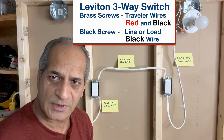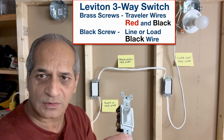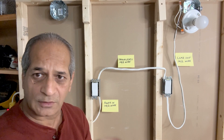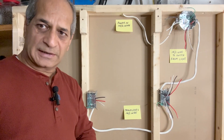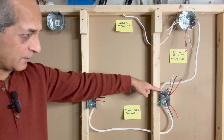In this demonstration I have used Leviton Decora type switches. To maintain consistency in the type of switches in your home, you might want to use a toggle switch. I'm using Wago lever nut connectors, but if you want, you can use simple wire nut connectors as well. As you can see, I have already laid the wires from the light fixture to the first switch box.